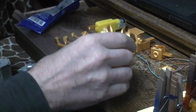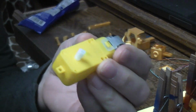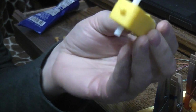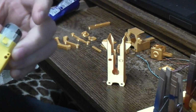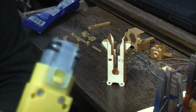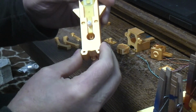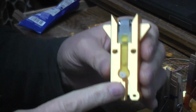This is the front. To operate this toy, we're just going to use one of the standard TT type gear motors. If you get the fast RPM one, then your robot dances fast. If you buy a slow RPM one, then it dances slow. So that's completely up to you. The two motor contacts where we're going to solder our wires on, I want those facing towards the back. So when we slide this in, you can see that this is the back view now.